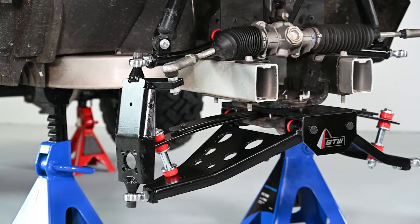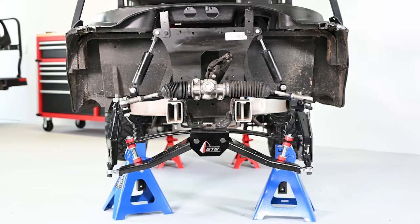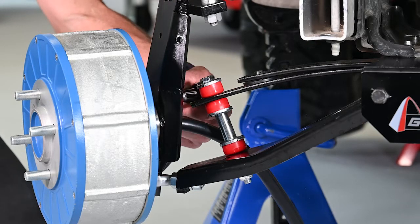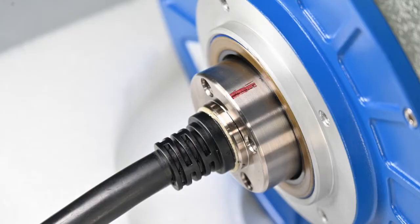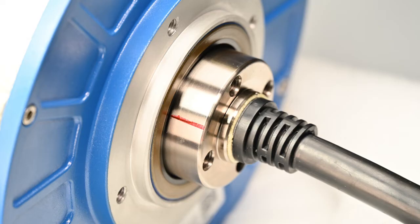Reinstall the nut onto the steering arm and tighten all three connections. The passenger side adapter bracket is now complete and the driver's side can be done using the same method with the bracket labeled DS-L. Installing the electric motors properly is the most critical part of successfully completing the Silverwolf 4-Wheel Drive upgrade to your cart. Both motors are the same — there is no left or right motor, so you don't have to worry about putting the wrong motor on the wrong side. You will notice, however, that both motors have a mark near the bolt holes on the cart side of the motors. It is important to install the motors with this mark facing upwards. If the mark is not at the top of the motor when mounted, you will experience performance issues and the drives may not work.